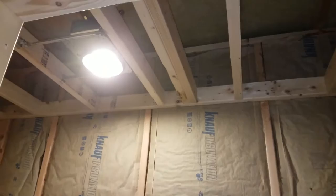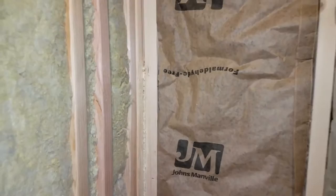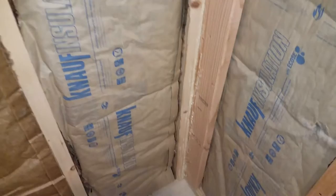And then there's a big closet. I'm not going to insulate up above — I have insulation between the rafters. Plus I ran out; I was going to put some in if I had extra, but I ran out so I'm not going to bother. And then I had some gaps where I put the wall in, so I just did some expanding foam in there. It kind of expanded a little too much, so I had to cut it and shave it out.